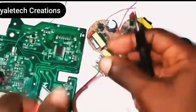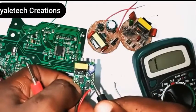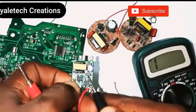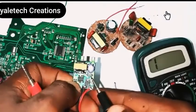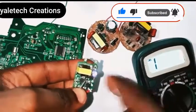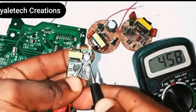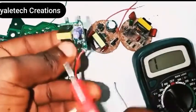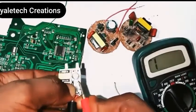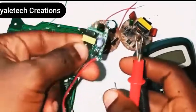You will come across bad ones on one of these panels. Now I have an SMD diode — like those ones on a board — they are quite different from the single ones. Sorry about the quality of my camera, just bear with me. If I put my probe here and test this SMD diode — you can see it's reading in this direction. Now let me turn it — if I put it to this side, it's not reading. So the diode on this panel is still okay.